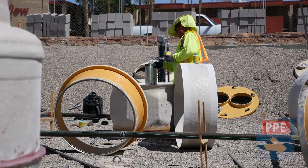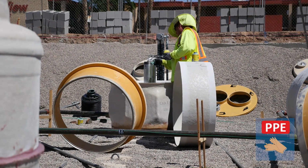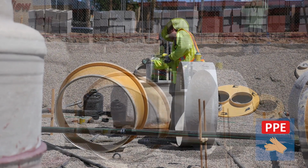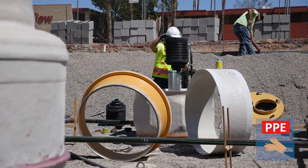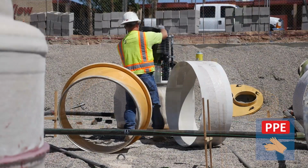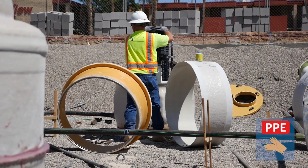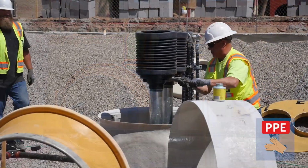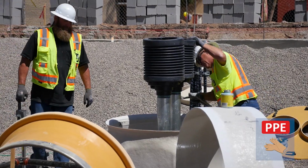Once the risers are installed, install the P761 spill buckets onto the appropriate riser. The P761 spill buckets are manufactured with a factory machined thread, so there is no need to install a face seal adapter. Double check that the riser lengths are correct by measuring the distance from the top of the spill buckets to the string line and ensuring that it is within the proper tolerances.